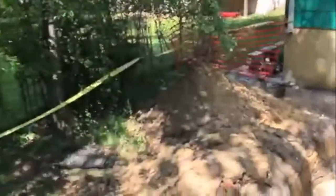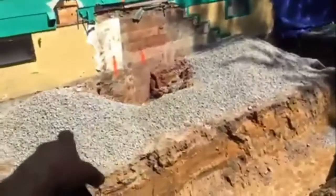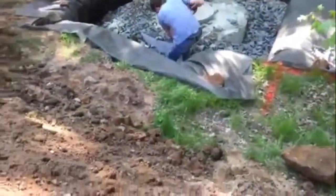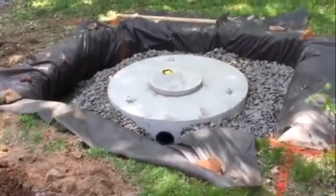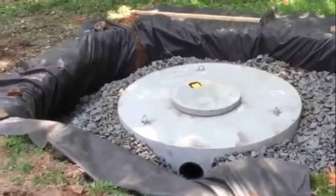You can see we have all the footings dug out, we have our safety nets up, we have a center pier dug out, we have our excess stone in the center for the slab later on, and right now we're finishing off the seepage pit. So that is the install of the pit. Now we're going to get an inspection, come back tomorrow, take a look at it, and then we're ready to backfill and cover this up.